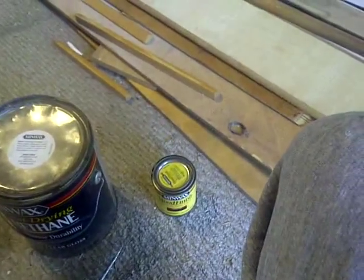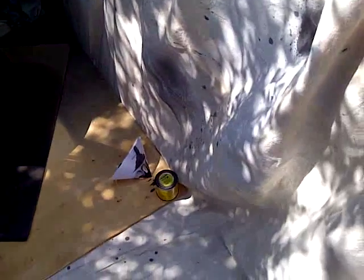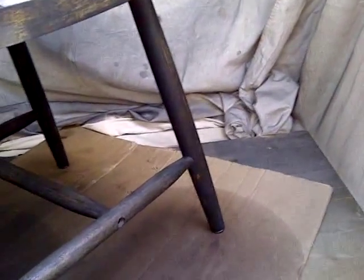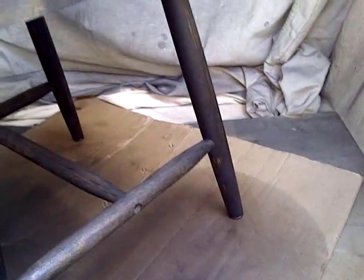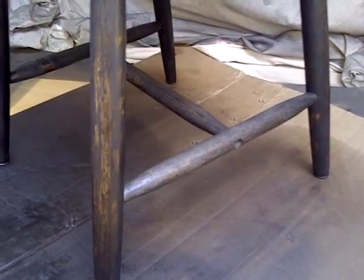Anyways, let me cut out, and I'll cut back in. Alright everyone, I'm cutting back in, and I ran out of stain. Probably have to get another one. So far, this is kind of what it looks like. I did the top last. This is what it looks like on the bottom, and it's not really accepting. I'm not sure. This stain is really old, so I'm just trying to use it. I may have to do a couple more layers of this stain. After this, I may even take a cloth and rub it in, see if it will take it.